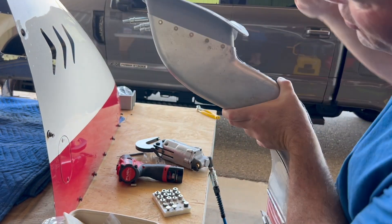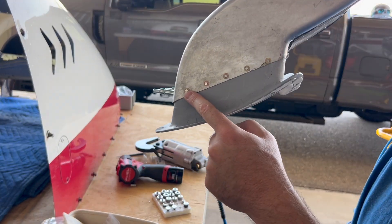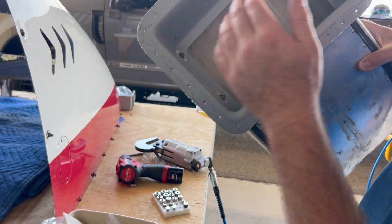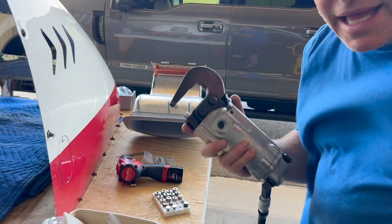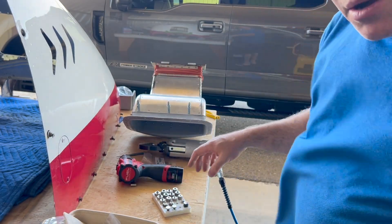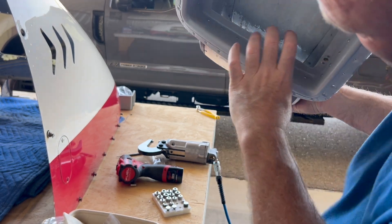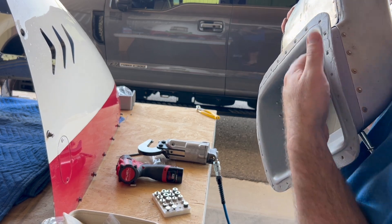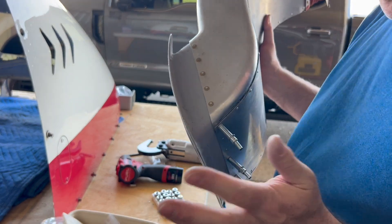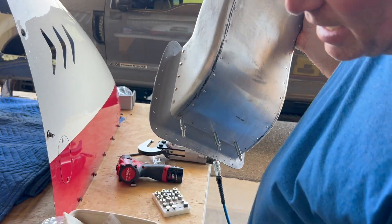What I'm doing right now is going through all the rivets attaching it to the plenum. I've got all three sides done — you can see the rivets going from the inside out, and I put a washer on the back side. It's coming out really nice. I've just got one last top row to do and then this piece will be pretty much done, ready to go back on the cowl. I'm using my handy dandy pneumatic squeezer — a pretty awesome tool. This row of rivets was impossible to get to with a rivet gun, so you needed to squeeze them.